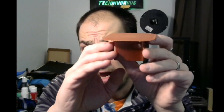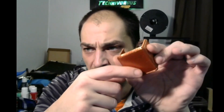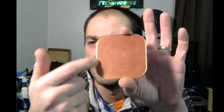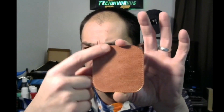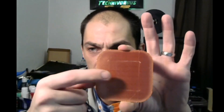The other alternative to printing with a brim is my personal favorite — the raft. This actually comes off pretty easily, and you don't get quite as fine a bottom surface as you do just printing off the PEI, but that's okay. The nice thing about the raft is that it goes down in separate grid layers — it'll go sideways with spaced apart lines, and then turn the other way and go back. After you get up a couple layers, you end up with a smooth surface to print on, which is really nice.